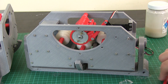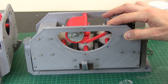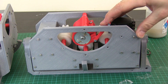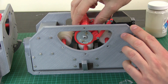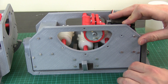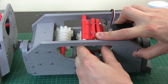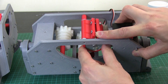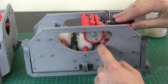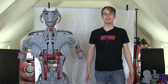I fitted those parts — I used the shorter lever in the end. Now when the servo moves, it moves the motor between the different gears. There it's nicely locked in position. In the middle it's pretty good, although the servo's in the middle of its leverage so it's not going to be as locked, but there's not too much resistance to that cradle turning. In this position we've got a bit of a problem because this can pop up. I probably need to put an end stop on there and make sure that when the motor turns in the direction that's going to push it that way, it's actually winding the elbow up against an end stop. Apart from that it works pretty well. Let's talk about series elastic actuators.